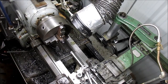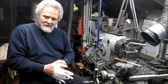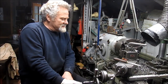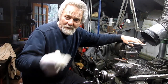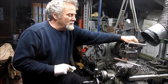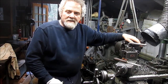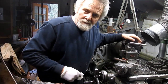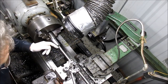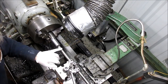Now let's do an accurate check. Hi, Nick Collier here. We're moving along with this piece. What happened is yesterday the bore didn't come out right, so we have to start again. So I brought us back to the place where we left off. Basically, we're going to go in and bore out the hole and then come back in and finish the surface treatment. So stick with us — we're going to be boring some holes today. This hole is so tight; I've got probably 10 or 15 thousandths on each side of the boring bar itself, and yesterday we hit a bunch of galling because it was so close.